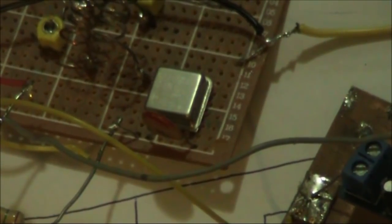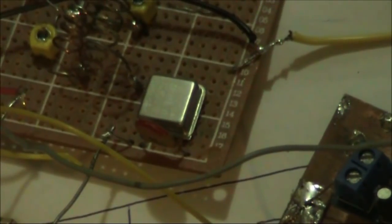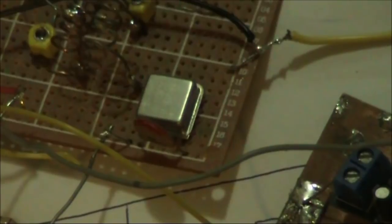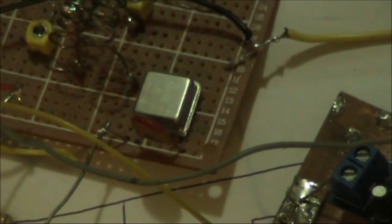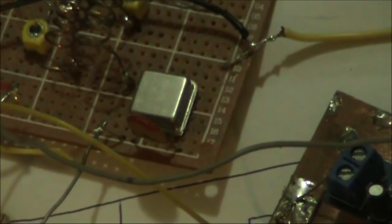Another is 3.686 MHz. Those modules could be useful either for QRP transmitter experiments like we've done here, or with an amplifier or two added for more serious power. There's also the potential of transmitting double sideband with a balanced modulator added after the oscillator module.